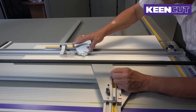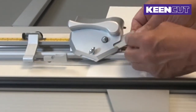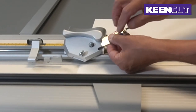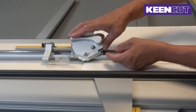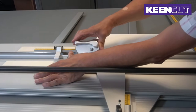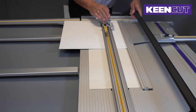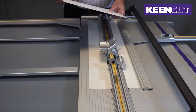The blade depth looks to be a little deep, so I'll remove the blade holder. We undo the screw at the back, perhaps half a turn, slide the blade back so that it's hard onto the screw, then place it back in. I like to push down on the back here while I tighten that. Press on there and engage the blade down to the bottom stop.